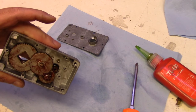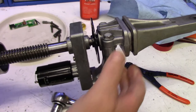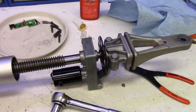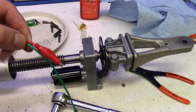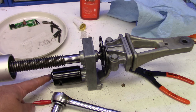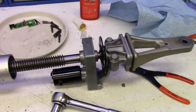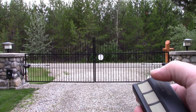Put the back on and button this thing back up. I've got the gearbox all buttoned back up — now we'll put it back onto the arm. It's all back together and bolted together. We'll get the other one together too. One thing — I haven't hooked up the wiring to the motor yet because I'm not sure which direction the motor turns. So I'm just going to use some alligator clips to test it first — hook it up to the wires in the box, see which polarity goes where, and figure out which way to hook the wires up so it's opening and closing in the right direction. You could also switch the wires around in the control unit, but I'd rather have them at the right polarity at the motor. Both opener arms have got the new motors in, everything's back together — let's see how she works.